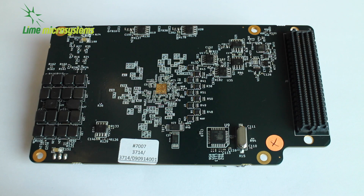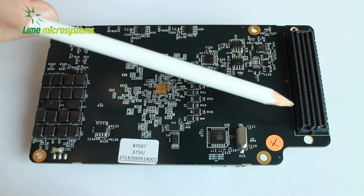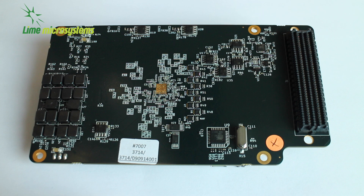On the back of the board, we have an FMC connector, which provides interface to our Limelight interface. This is able to support JESD207, as well as MUX IQ parallel input and output. There's also an option for an external analog filter between the receiver outputs and the ADC inputs for narrowband filtering below 600kHz.